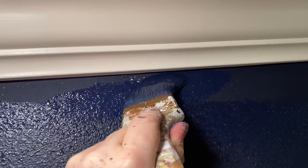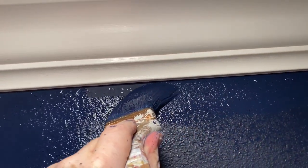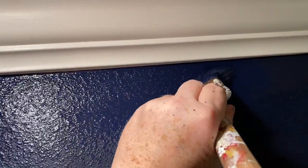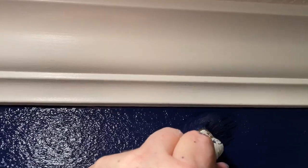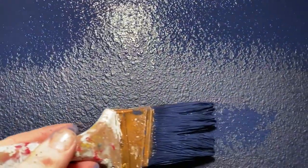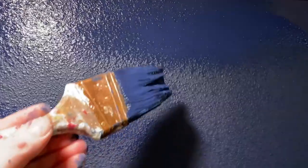Remember, I showed you the various ways you could cut this line, right? And I'm going to employ the one that works best for me. I showed you several. But look at how I just tidied up the line. You see, on the first go-round, you can't get it perfectly straight. But here, since your surface is now freshly coated with paint, your brush glides. Oh, it's true. It glides over that first coat. I mean, we're talking a fresh coat of paint that isn't pitted. So on the first coat, our brush did a little skipping, right? Remember how the brush skipped a little bit?